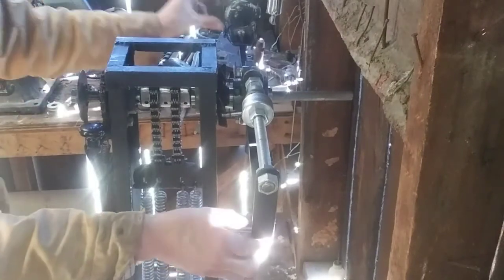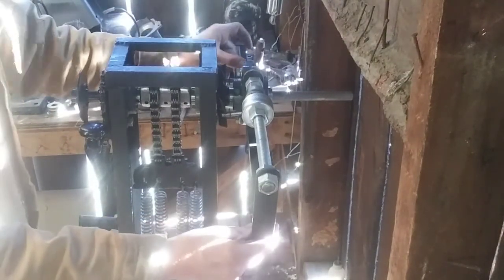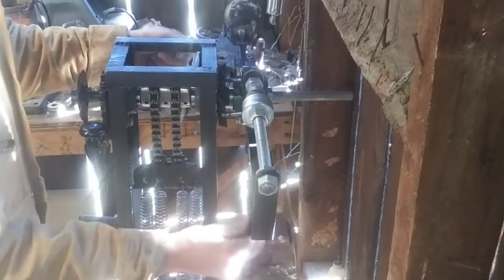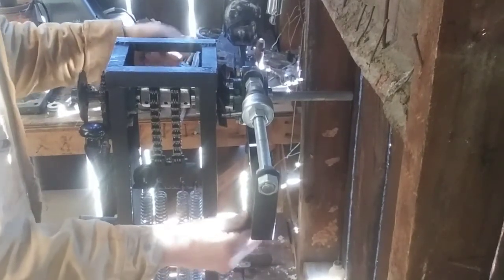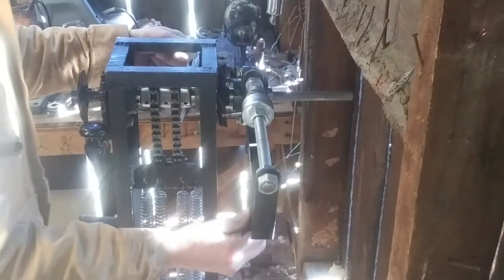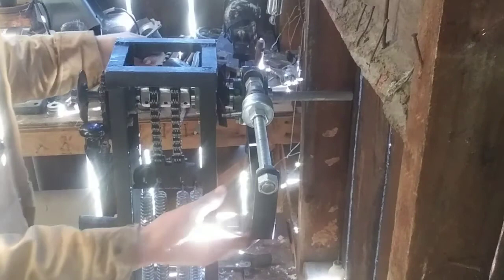So we would have our mold right here. You'd have your crucible in the holder, and you would be taking your blowtorch and shaking it around a little bit, melting it. You're melting your metal right now. After about a minute or two, your metal is melted, and what you would do is slide it forward up to your mold.